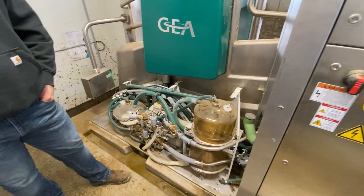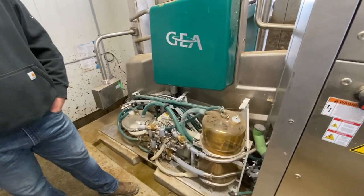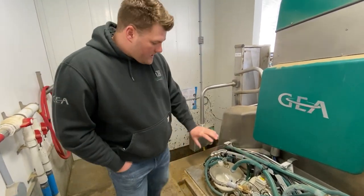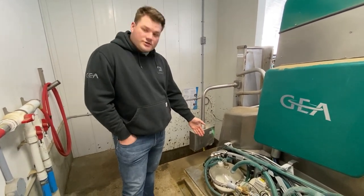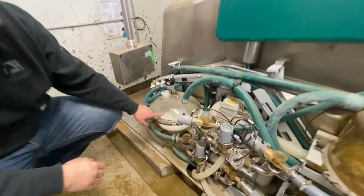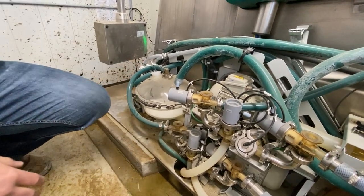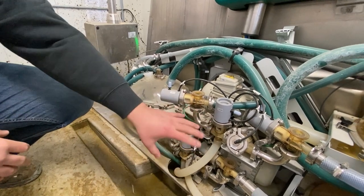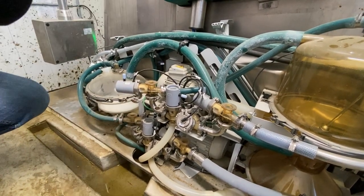Oh, so I could sort from a calf, obviously. Yep, exactly. Keep it here, or send it to a bucket. Oh, that's pretty. So we start there, and then as soon as we consider our milk good, off our UV sensor, it goes right to good milk, start filling this, and we have a float on here. As soon as we get full, I think it'll hold about 21 liters in here, it fills up, and then goes to the good milk tank. Pretty slick. And we have our decision valves here, which basically determine whether we're going to go to the drain, calf milk, or to the tank.